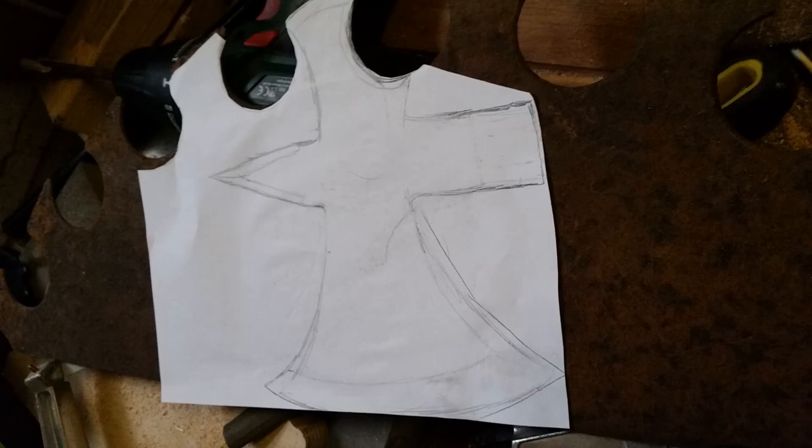So I started off with a piece of old circular saw blade from a sawmill which I got, and this is left over from when I made my full tang sword. The link will be in the description to go and see that video, because this is made from the same steel. The reason that I picked steel from an old circular saw blade is because it's already been heat treated, so it's really hard and very tough.